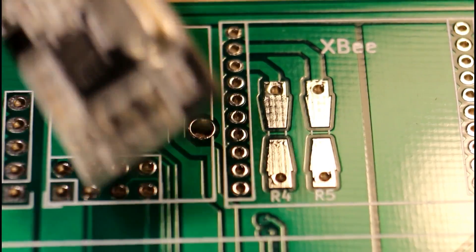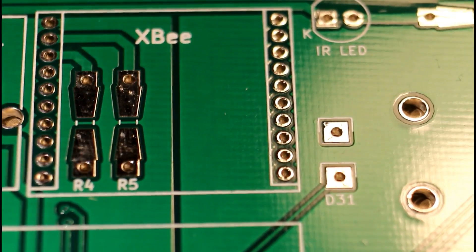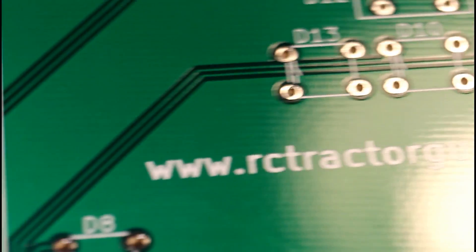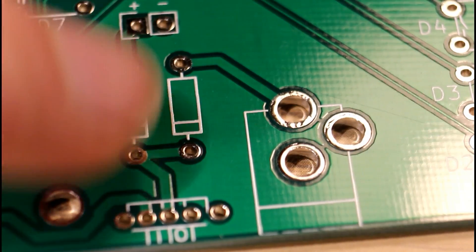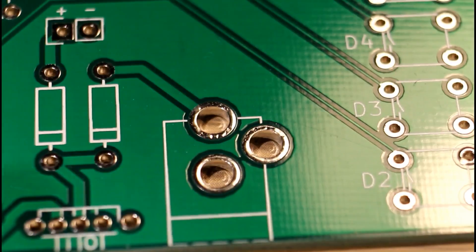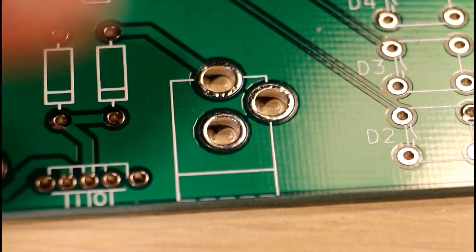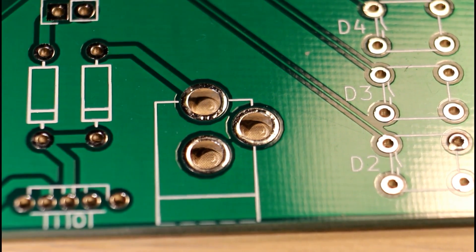There's a little switch you can use to maybe change channels or something — I haven't written it into the code but it's there if you want it. The NRF24 module — the bigger version — goes there. On the other side there's an encoder, joystick, more switches, and switches for an LCD or TFT. There are also battery contacts and diodes to prevent damage if you connect the battery backwards, and it should also prevent damage if you plug in a DC power supply while the batteries are still in it.